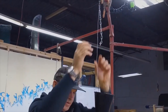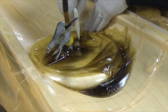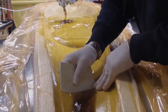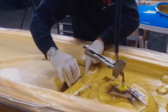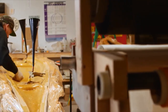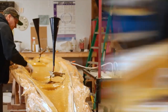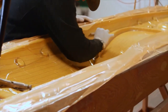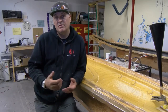When we hook up the funnels and we introduce the resin, there's good flow with the resin throughout the fabric. That resin eventually works its way through the boat and replaces the air with resin. We end up with a really good resin-to-fabric ratio, and that allows us to build a boat that's really strong and really light.